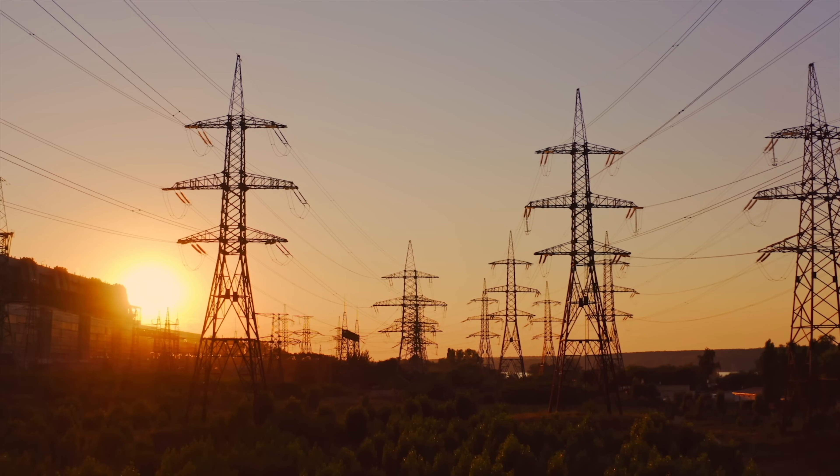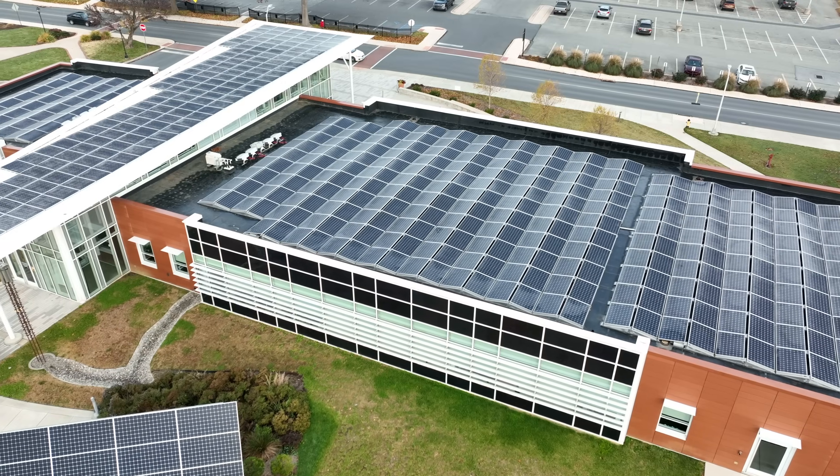The question, given that these solutions are out there now, is: what size solar battery do I need? One of the things people probably don't understand about solar batteries is that there's really not a lot of point having a battery with a capacity where you don't ever have enough surplus power to charge it. In some cases, however, it might be worth it — and most of the modern solutions now support charging the battery from the grid as well as from solar. So there are a few different options when sizing.